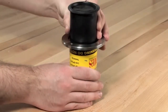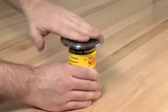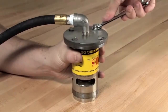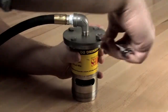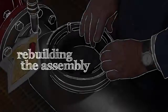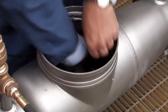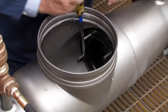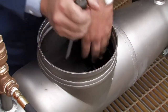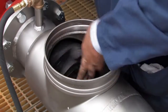Reinstall the assembly in the relief valve body with the hex head bolt entering the flanged end first. With the unit properly seated, reinstall the cover plate and tighten the four bolts evenly to ensure a firm seal. Checks should be reinstalled hand tight in reverse of how they were removed, with the number two check going in first, followed by the number one. The number two check should be tightened by placing a long screwdriver between the lugs and tightening firmly. Tighten the number one check by hand only.